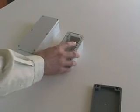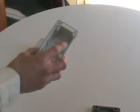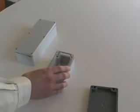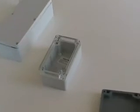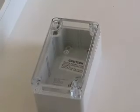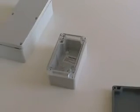Style 2 is a light gray polycarbonate body with a clear cover. This part number has a suffix of C for clear. It is UV stabilized and can be used for indoor and outdoor use. The clear cover can be beneficial as it lessens the need to make cutouts in the box.